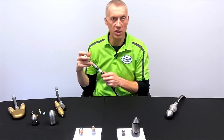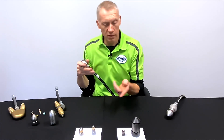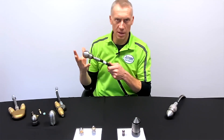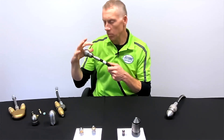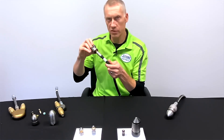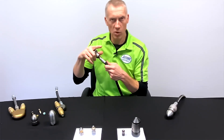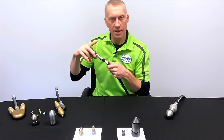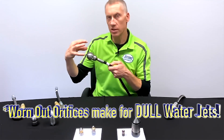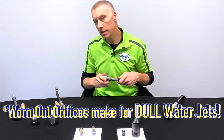That's also the approach for grease — grease that's too hard for your spinner nozzle, even a controlled speed grease hog type. This nozzle type, with its penetrating action and very sharp water jets, uses replaceable orifices precision-machined to create a very sharp water jet that can cut into harder grease. For descaling, it's going to have more penetration to get that scale off the pipe wall.